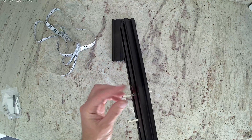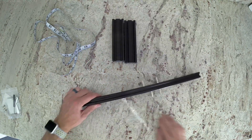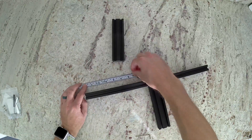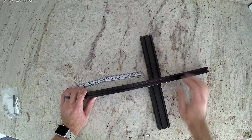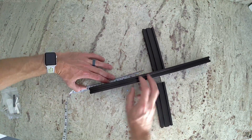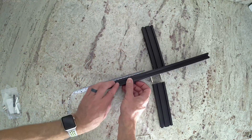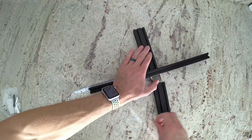When you assemble this printer, make sure you have a completely flat surface to do it on — it makes the process a whole lot easier. Now we're going to measure from the front of the extrusion back 190 millimeters, and that's where we're going to set the 250 millimeter extrusions. I'm going to put the front of the extrusion on the ruler at 190 and then easily move that up to be at the right spot.